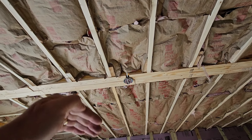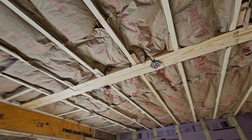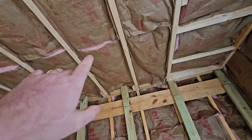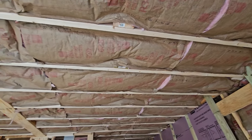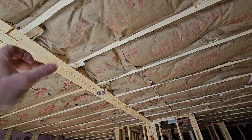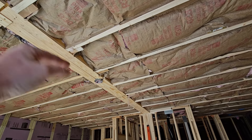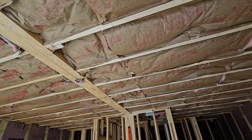In between this floor and the floor above, we have R30. Most people are going to use R19, but we had 2x10 floor joists so we were able to use R30. These right here are 2x4s that we scabbed down so that the 2x10s match the height of this beam — a way to make it all line up nice and evenly — and we added a three-quarter board below the beam so we had room to get our wire in for the fan box.